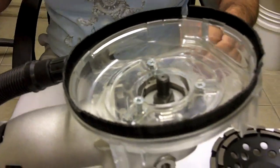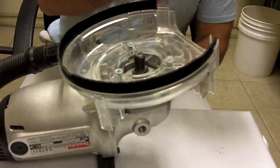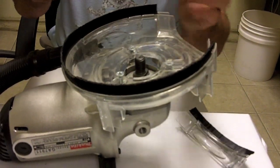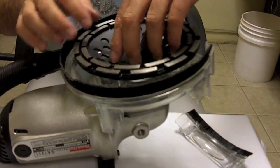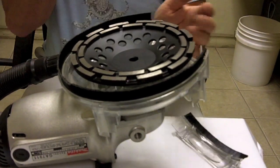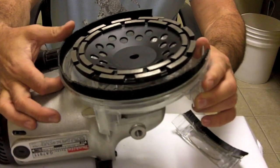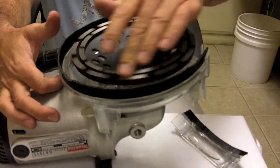One of the neat things about this tool is the ability to grind up close to corners. This rounded area often won't let you get flat into a wall, but if you're using a 7-inch cup wheel, you'll get right up to the edge — almost hitting the edge, which is what a lot of people want. It's spring-loaded, so the more pressure you put, the harder it'll grind.